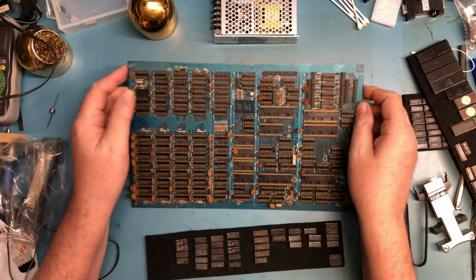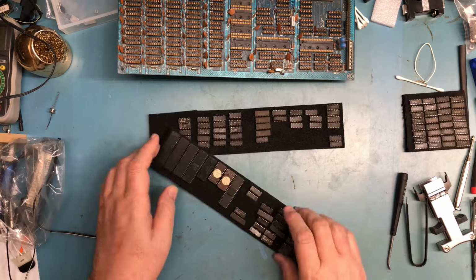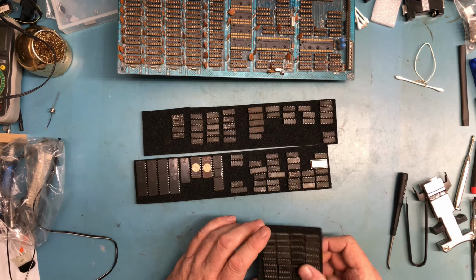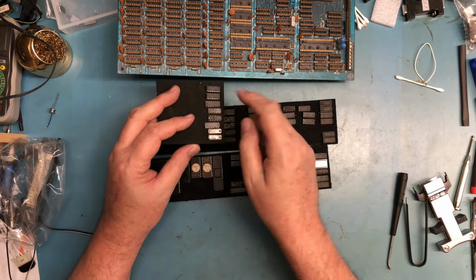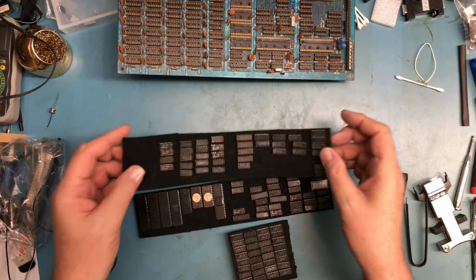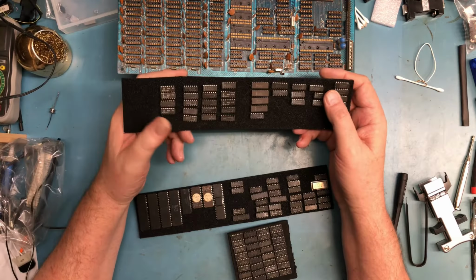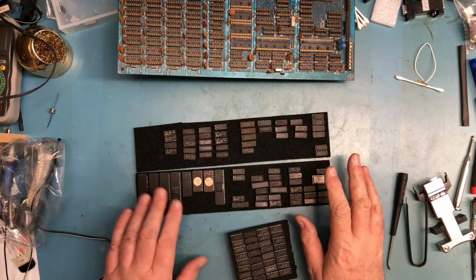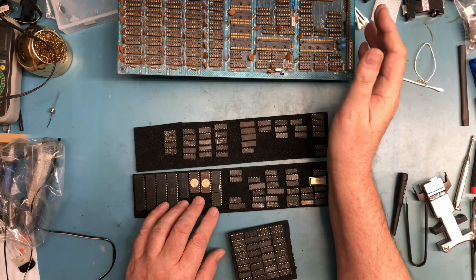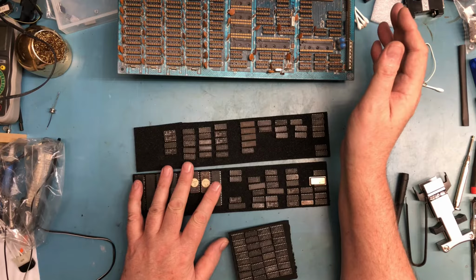Well, is there anything else we can look at here besides the chips we pulled out? Of course, the DRAMs in this orientation, the logic to drive them there, kind of this whole bottom corner of the board down here, the upper board all the way across. Yeah, these 4 here become those 4 there. So we've kept positional for the logic. The PIOs, of course, there's 2 PIOs. I could swap those accidentally, and it wouldn't matter. I'm not tied to keeping those in the same socket as long as they both work. So the larger chips, I just didn't feel like I needed to maintain a positional orientation.